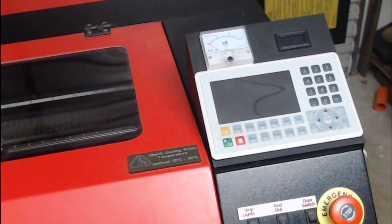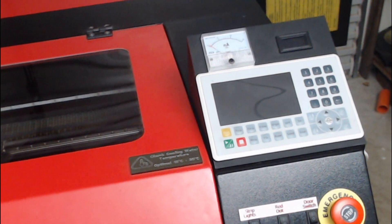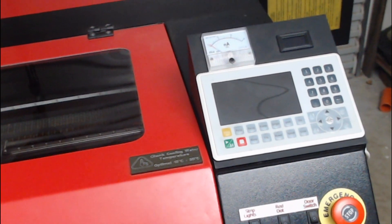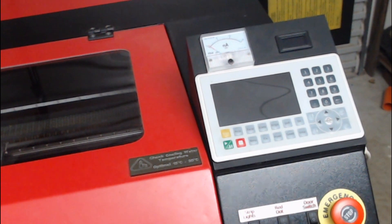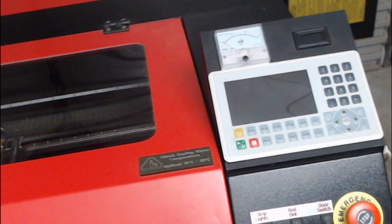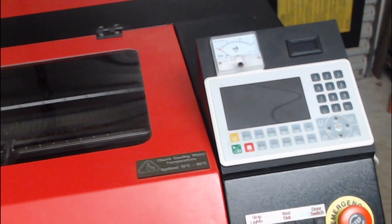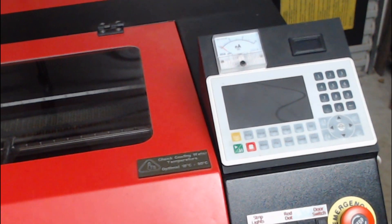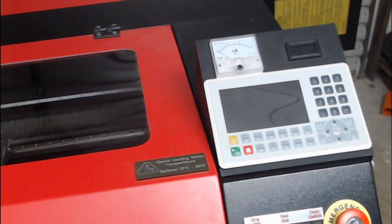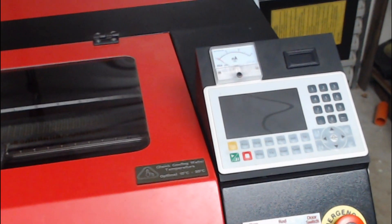The installation of this milliamp meter has allowed me to refine my cuts. It's nice to say you cut at 50% power on an 80-watt laser, but what really matters is paying attention to how many milliamps are needed to cut a piece of material. You can refer back to this later — if 50% isn't cutting like it used to, you can check whether the milliamps have reduced, which would indicate a weakening of the laser tube and that you may need to order a replacement in the near future.